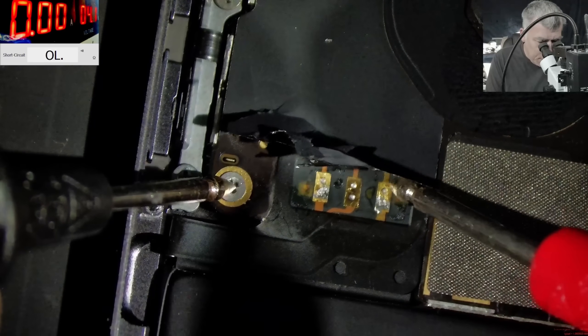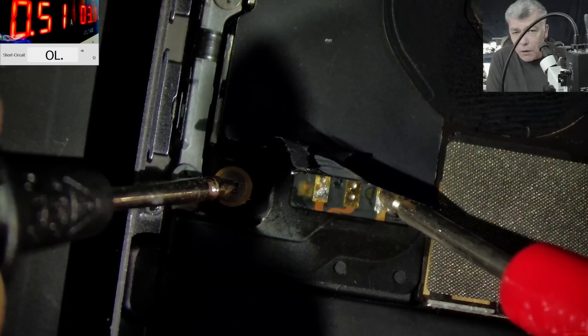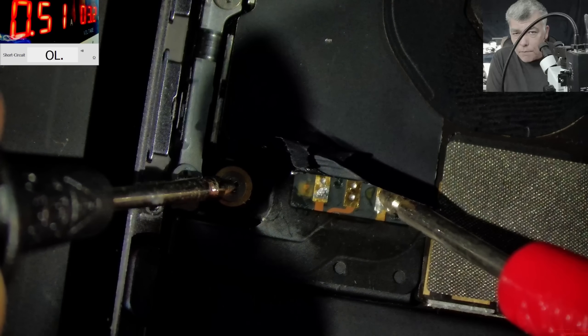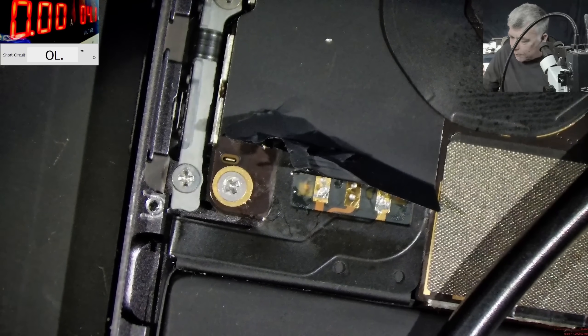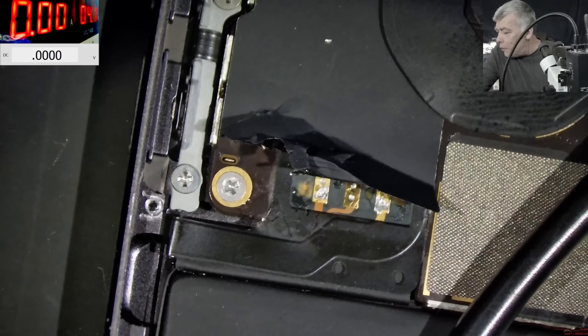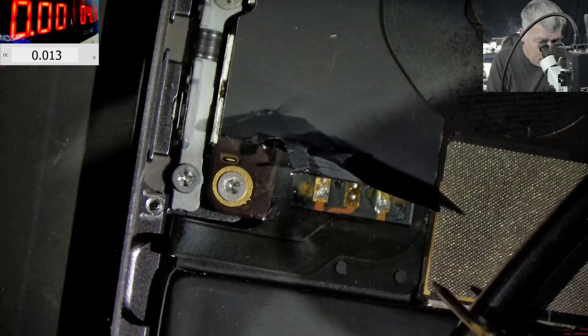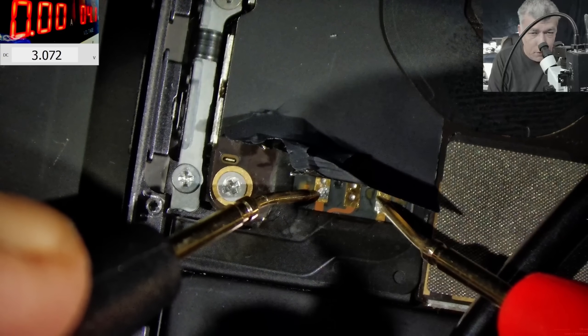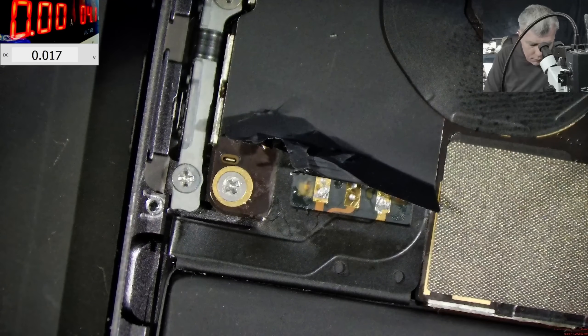I have ground there and plus here. The battery is charging at 500 milliamps, voltage is 3.1V and going up. I can only hope this current is being taken by the battery and not by something shorted on the board. The voltage is now 3.3V and continuing to rise. Checking the voltage — it's going to zero slowly or staying stable. The battery has 3 volts — it's not a short on the motherboard. It's stable at 3 volts, so the board is not discharging the battery.